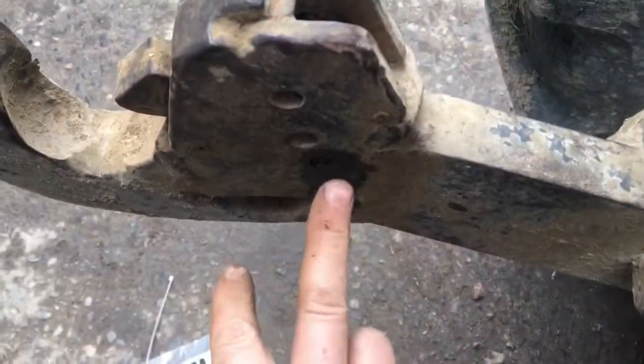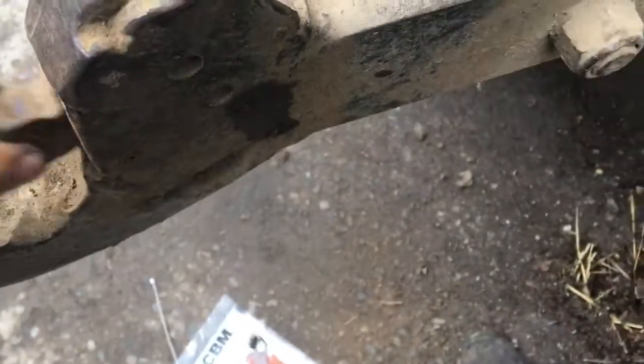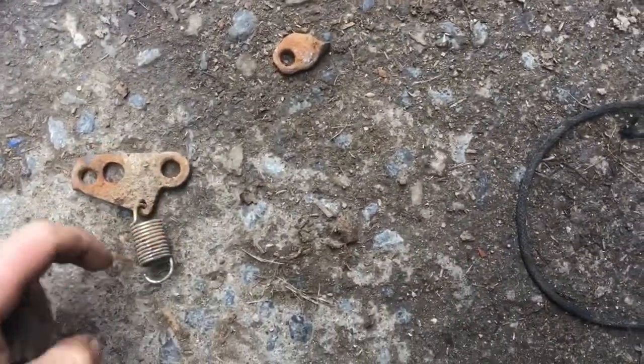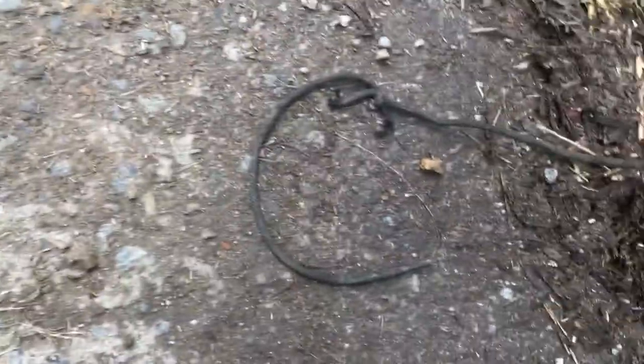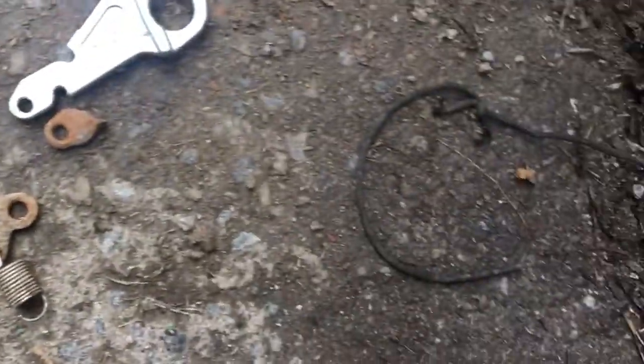Please do subscribe. Now with the two roll pins removed, there's nothing actually holding this in apart from a load of dirt, so I'm just going to shake it for a bit. You can see all the dirt falling out. So what do we have? We have the triangle piece, the spring, this is the lock, and this is the end of the release — that's why it snapped off. I have a new one of these to go back in.